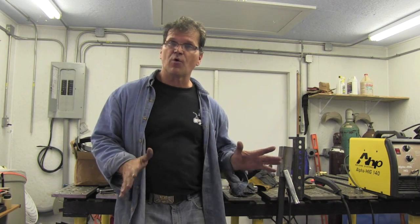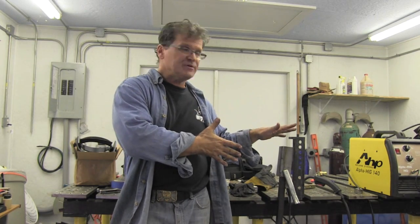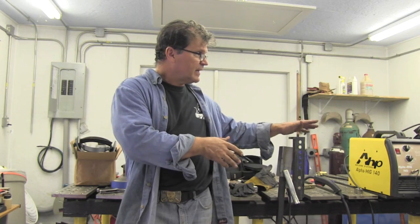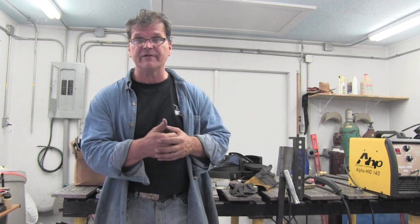Just got finished with all the outside corner joints, and here's a couple of observations. Number one: this is a transformer machine, the AHP. These are both 140-amp MIG machines. This is a transformer style, a little heavier weight-wise — maybe 10 to 20 pounds heavier — and it seems to like a little less wire feed speed; it runs better with a little less wire feed speed than the Everlast. I know from experience that this one runs really well with CO2 — you can get a little bit more heat out of the CO2 on this one. Let's take a look at that repair I did a few months ago using this machine along with CO2 gas.